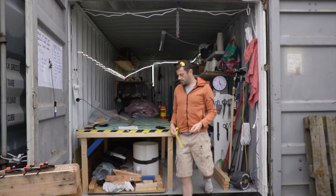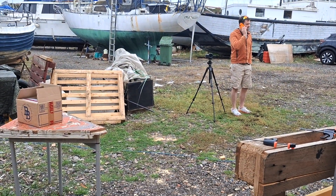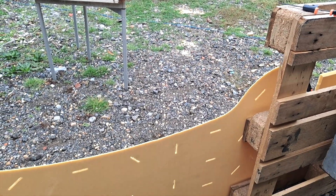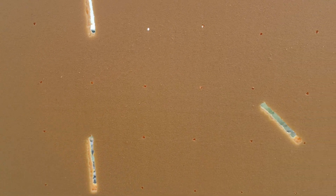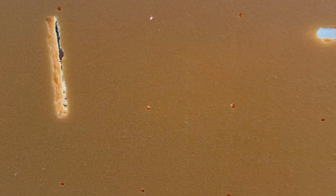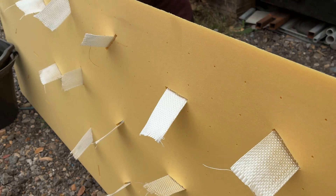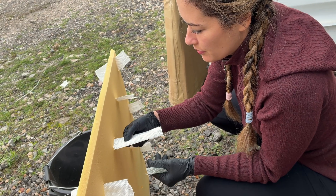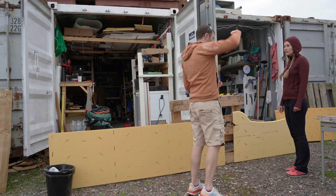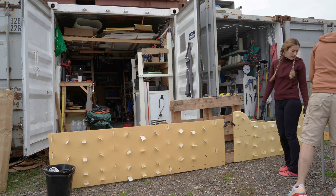Not before this cinematic drama caused by accidentally switching the new camera into slow motion mode. But now to completing the foam — we thought having them upright would be easiest. All of these slots need to be filled, and you'll forgive me for showing you the neater ones, not the handful where the saw blades slipped. Individually cut slips of glass fibre at 600g per square metre. Glass, if combined with epoxy, gives superior adhesion compared to other composite fabrics. It's unidirectional, so we need all the strength along the length of those tongues. This needed doing across all of the shaped sheets — the left one is a side panel, and the other one is for Bernard's rear end.